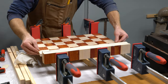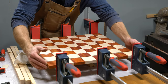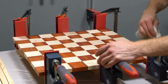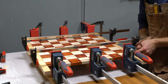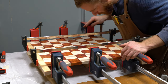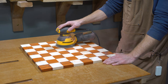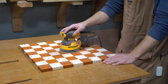At this stage, you can see why wood selection in the beginning is so important. It's best to use lumber that has a uniform color without much variation — that way when the boards are cut up and spread out into 64 different squares, the look stays consistent over the entire length. There are two big mistakes you can make at this step: accidentally clamping with far too much pressure causing the boards to bow as the glue dries, or not aligning the boards properly to make a perfect grid. I recommend clamping reference boards to either side to sandwich all 8 strips together, which takes the guesswork out of aligning the grid pattern. After gluing, I'll sand the intended bottom with 40 grit sandpaper to smooth the surface and remove any dry glue.